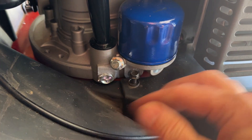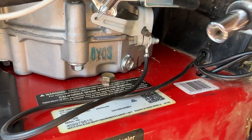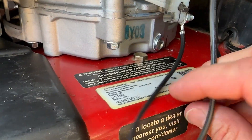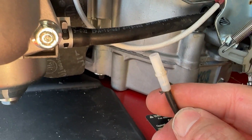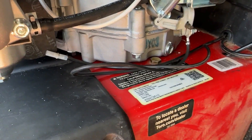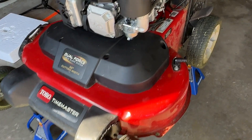I had to make dinner so I didn't show you this, but I removed this nut here with a 10mm wrench and connected the ground right up to that — probably the best place to connect that old ground. There's another wire here for your kill switch. What I would do is put that together here so it's an easy kill switch — this one goes up to the one on the handle, but to do that I'd have to splice this and make a Y, so I'll worry about that later. At least the ground is in. I put oil in it, it's been sitting for a while. I'm going to fill it up with gas. I still have to fix that transmission, but to do that I'll have to take it off the blocks and put that two-by-four in like I did before.